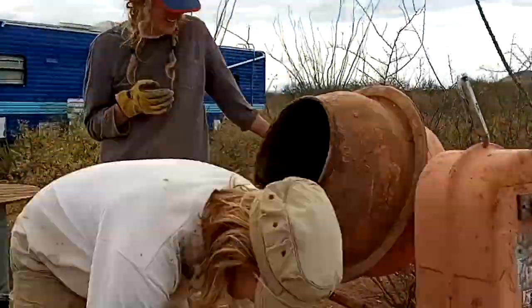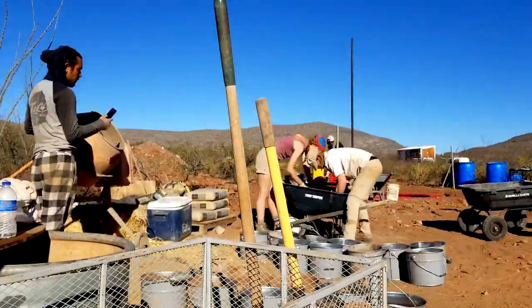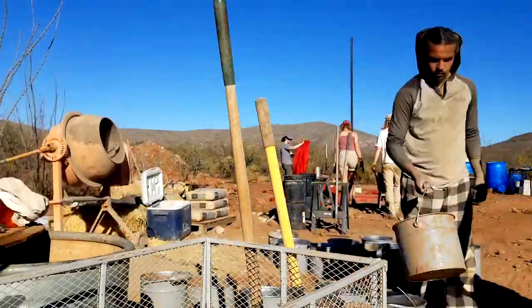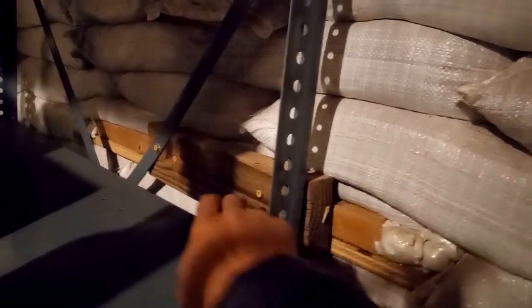The other thing is a cement mixer. As you sift the dirt, you have to wet it so it compacts and forms into bricks. I don't know why we didn't buy a cement mixer, but since then I've gotten two cement mixers for our Hyper Adobe and that saves so much time and energy because hand mixing is really, really difficult. One thing I would have done differently on this build is to put in more cleats. You can't have enough cleats in the walls — it's basically a 2x4 with some nails sticking out that is set into the wall so you can screw things into it.